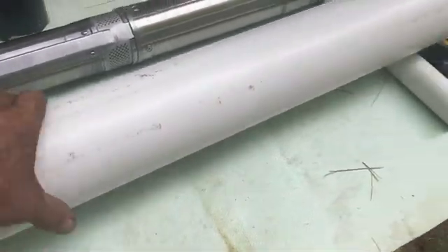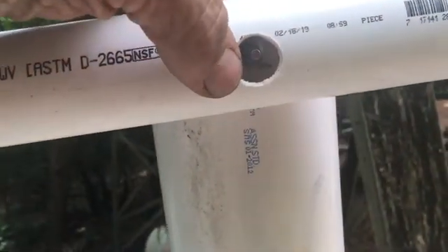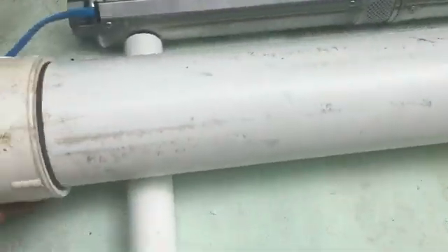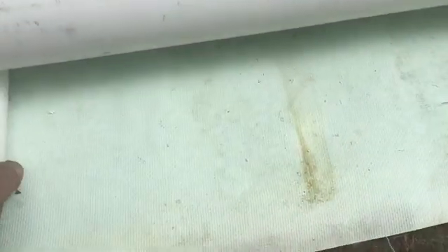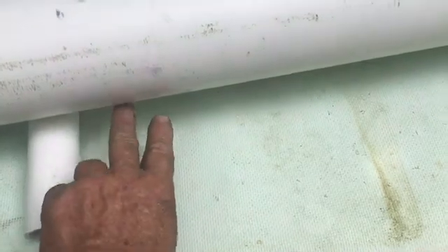Here it is sitting on the legs — it'll be sturdy. We've got to glue some strips down on the inside yet. This will be the cap. Pump end will come out here, pump will be sitting in here. The water has to come in one end, draw across the motor, and go to the pump. This also keeps it from rolling around and lets sediment build up in the tank without the pump sucking it up.